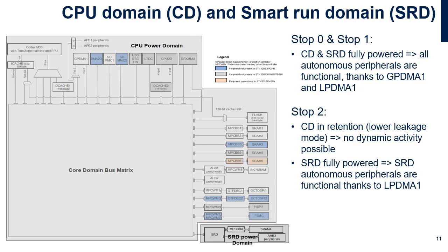The autonomous peripherals mapped on AHB3 or APB3 belong to the smart run domain and are autonomous in Stop 0, Stop 1 and Stop 2 thanks to LP-DMA1 and SRAM4. While in Stop 2 mode, the CPU domain is not active. However, background tasks can be in progress in the smart run domain including data movement thanks to the low power DMA.